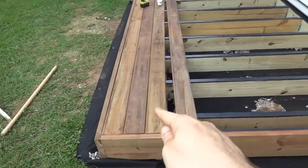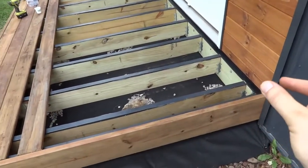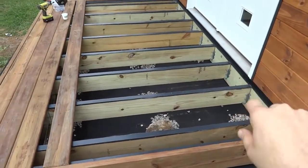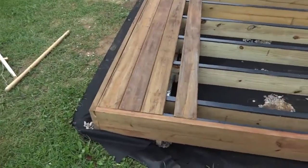So I'm starting here with full boards and once I get towards the house, the way that my measurements worked out, I'm only going to have to cut just a little bit off of that last board. Plus, it's going to get sucked under the house trim and underneath the door frame. So it's no big deal — that board would be a lot less noticeable than a little skinny one out front.